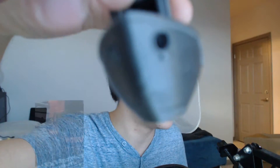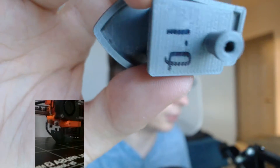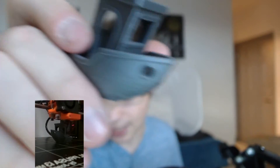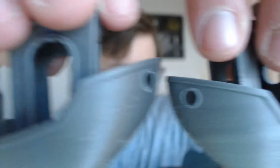So then I took it one step up — this is 0.1. Just as shiny, I would say. Less over-extrusion. The stair-stepping on the top is just as minimal. I think this model actually came out better. They were so close in quality that when they printed, I mixed them up — pretty identical.